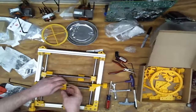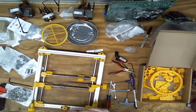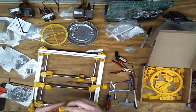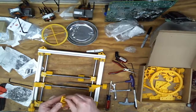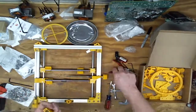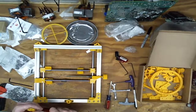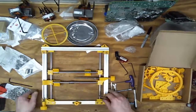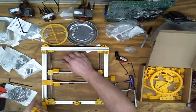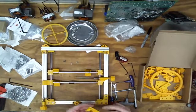This one might be it for tonight, because I gotta reprint this part. So, oh yeah, that split too. So I think I'm gonna reprint him standing up instead of laying on his back. It will eliminate that problem. I'm also gonna print it at 30% infill instead of 15, which it currently is at. And that will hopefully eliminate the current issues.